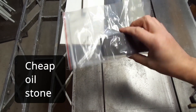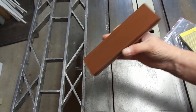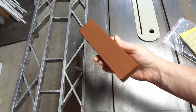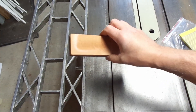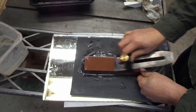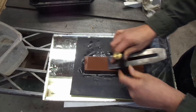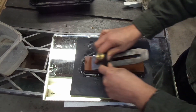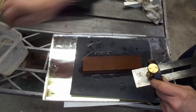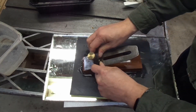Now let's talk briefly about abrasives, starting with stones. Stones can be hard or soft — you can get oil stones or water stones. They can be small or large, and prices vary a lot. Cheap stones are basically a piece of rock, while pricier ones are man-made from different materials. You have to keep the grit unclogged so the grit stays sharp, and you have to flatten them periodically. I'm not going to recommend one stone or another — there are different camps that promote different stones for their virtues, and it's really up to you.